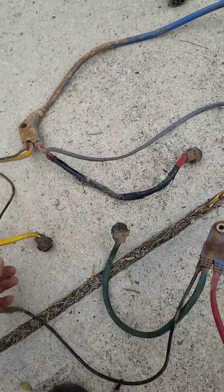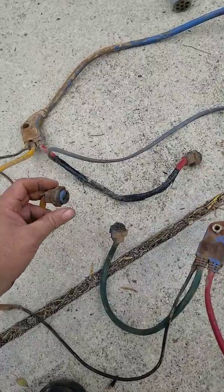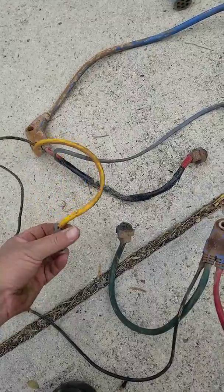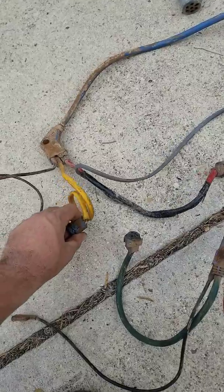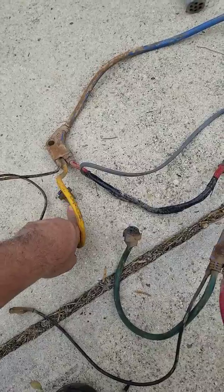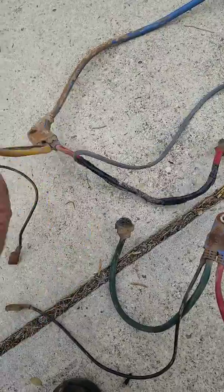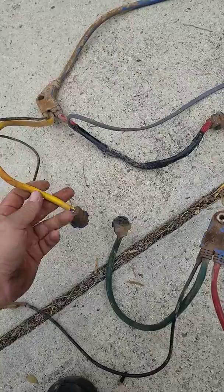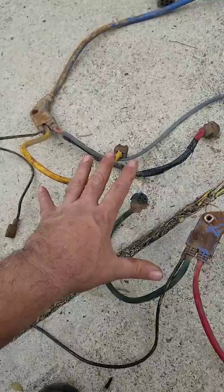the message for disconnected lights is that, I don't know if you guys know this, these cables, and this is a tip. If you ever see them doing this in the trailer, they're twisting. You know, they'll twist, and what'll happen is the wires will start rubbing into each other, and you'll have a short that you can never find because you can't see it. And the other thing is they'll go open circuit. This one actually went open circuit, and if you, with the light on, do this, you could get it to come on and off at will. So two problems. We found it.